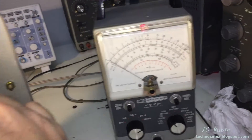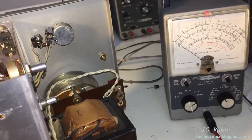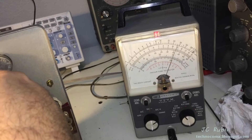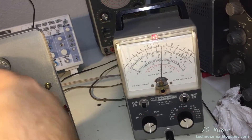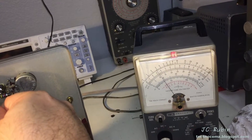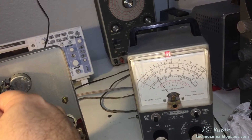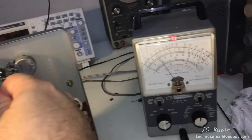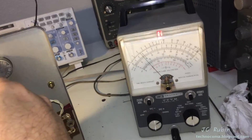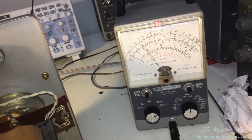The meter is slightly off — this could very well be 600 ohms; this one is good. Moving on to the next one, a 10k pot — I can see it makes its way up and just at three-quarters it starts to turn back down again. I can remove it from circuit and it'll probably work fine. If the problem reveals itself during troubleshooting it'll be replaced, but I don't think there's an issue with this one. I'll leave it alone too.